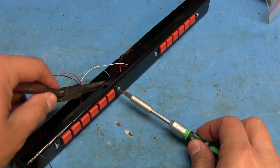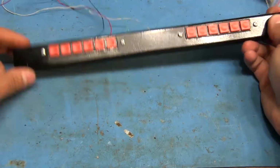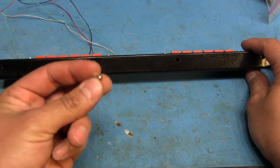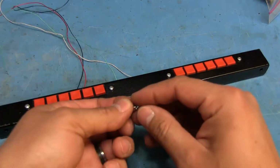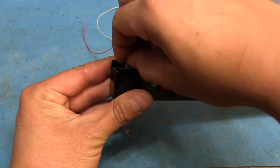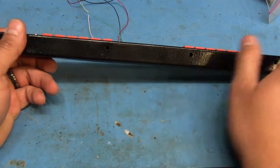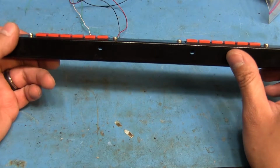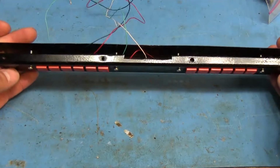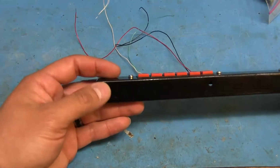So have you caught it yet? The problem, or my little design flaw? Okay, if you haven't caught it, these holes in the back were supposed to be for inserting these screws, so the head could just clear that hole, and on the other side I'd have the threads come out. The threads fit just right through, but it would hold the head from coming out. Well, the ones that were supposed to hold it in here, as you can see, are not going to go through at all. So these two holes are basically useless. I can't mount with those into the unit itself. But I still have the outside two, which are totally fine.